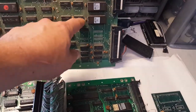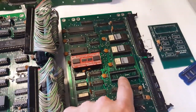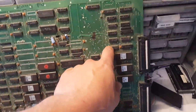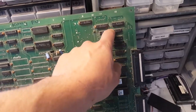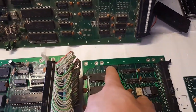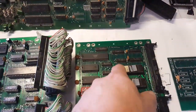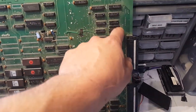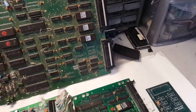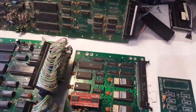Interestingly, we get those six LS166 chips, which are the same as the custom's sub-board. So it's safe to assume that this custom is the six LS166 chips. But we also have all these other chips here of unknown purpose. Looking at the layout, these three chips match these here, and these two match these guys — so we've got eight chips that have some logic to them, probably implementing one of the customs.